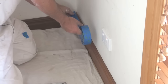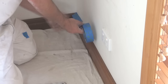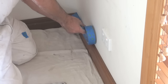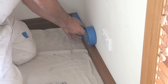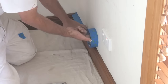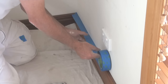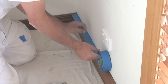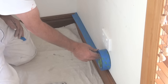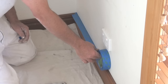Start from your corner and get it in there nicely. You don't rip it off in small bits — you always hold the roll like so. Then line the tape up and gently push it down. Holding the tape at the back, pulling the roll along and continuing on that way. The actual roll is held hard up against the wall, and this helps to guide it and get a nice straight edge along the wall.